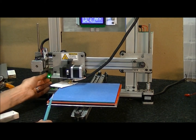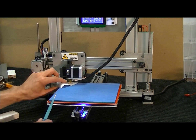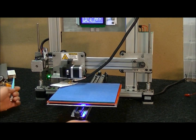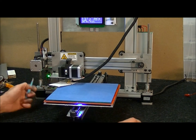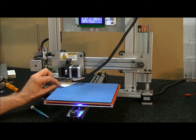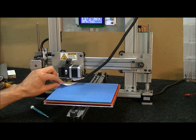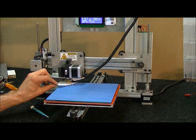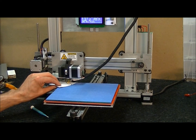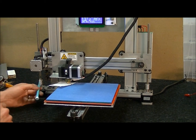If you're not within range, you can bend the sensor up or down, or move the whole end stop. Since it's currently too tight, I'll use the ceramic screwdriver to adjust. One trick: paper is about 0.1 millimeters thick. When you're too close to the bed, raise the Z in software by 0.1 mm increments and keep checking until you get the right tension. It took about four clicks. Now the LED on the board is off.